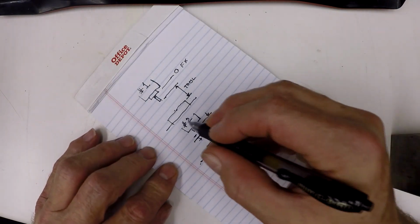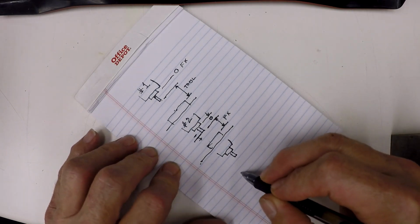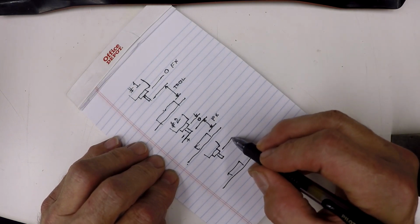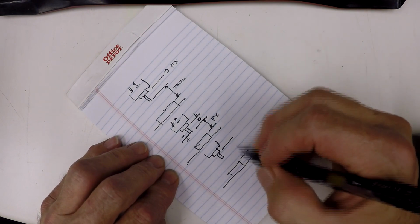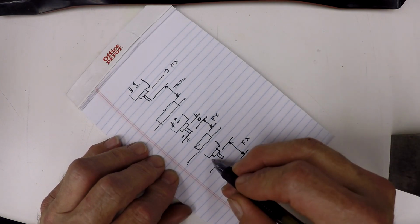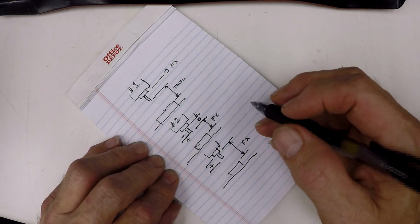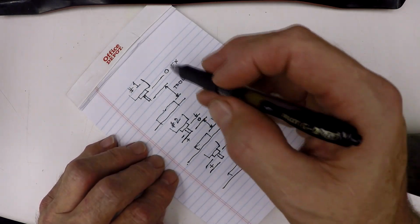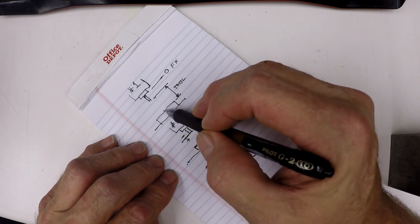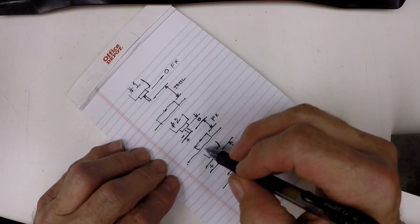Now the third way is very similar to the number 2 way. Draw the spindle again here with your tool, work down here on the table, but instead of using the reference tool, you set from the face of the spindle down to the workpiece 0 as your fixture offset, and then all of your tool offsets are going to be measured from the face of the spindle whatever length, and they'll all run in the plus direction. What the machine is doing is adding these to wherever you set the fixture offset. It's adding these numbers to bring whatever length tool down to the 0 point of the workpiece that you've set as 0. Now this would be the number 3, we'll call it.